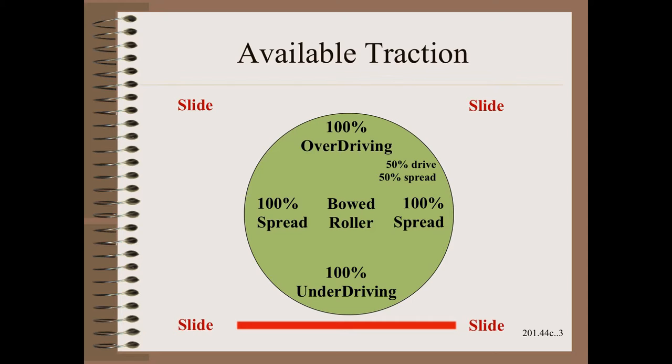Here, bowed roller mode spreading is not possible. Only bent pipe spreading is, and that is an entirely different discussion. Here, we will just observe that it is a pretty expensive way to get bent pipe spreading, and that you will quickly ruin the cover due to wear.